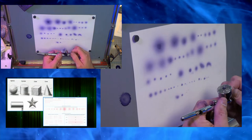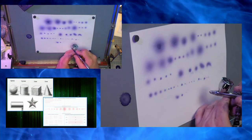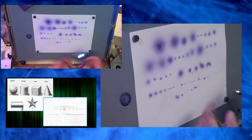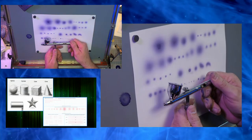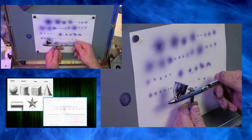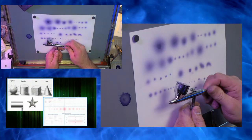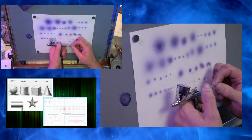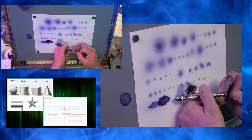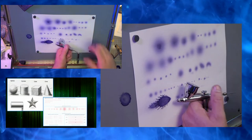Around the needle, not letting it seat properly. And when it doesn't seat properly, it creates that problem. It's still doing it. So what I do now, basic troubleshooting, aside from breaking down the whole gun, pull off the handle. I'll loosen the needle chuck, and I'll just spin and pull the needle back a little bit in and out, but don't draw it all the way out, or paint's going to go all the way down here, and you don't want that.